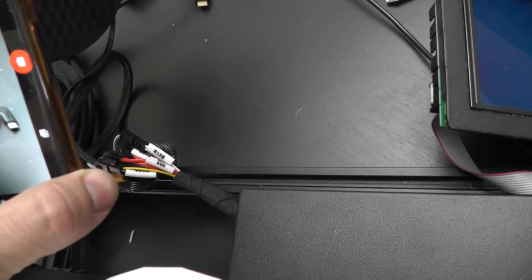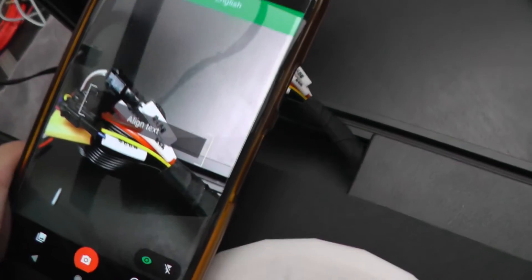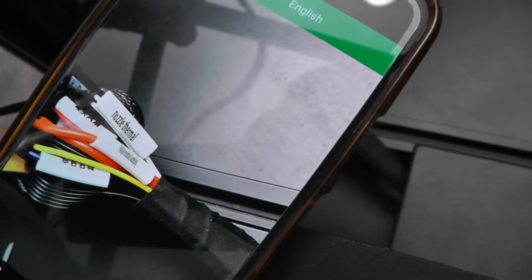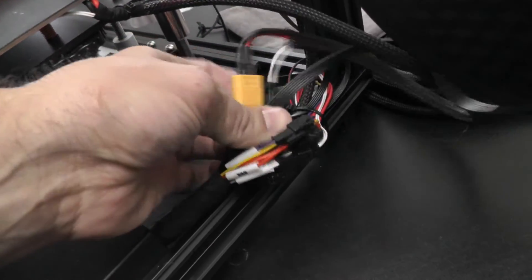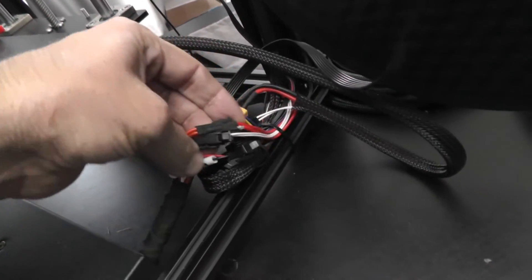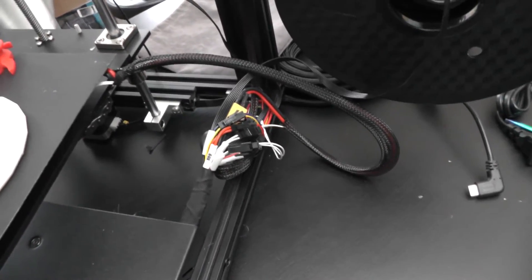As shown in my previous livestream, the connectors for all of the steppers, heating elements, and thermistors were all labeled in Chinese. This became a fun game for my daughter and I as we pulled out Google Translate to figure out which connector went to which element. Almost all of the connectors map one-to-one to the devices they go to — all wires except two have unique connectors, colors, or wire gauges. The only exception is the thermistors for the hot end and heat bed, which have identical connectors. If you're faced with figuring these out, feel free to plug them in one at a time when you power on the machine to see if they're in the right location.